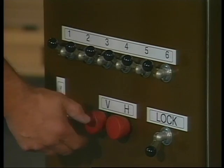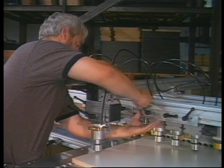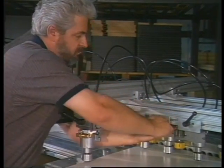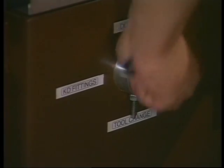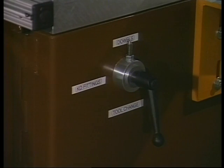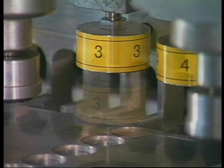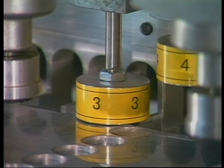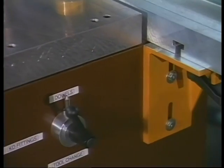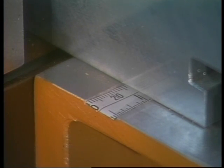For vertical boring, set the head selection switch to V and activate the red button marked V. Hold-down clamps are easily moved to maximize pressure on panels of different sizes. Next, select the turret control depth setting for dowels or KD fittings. Stops three and four are set to one-half the panel thickness. Stop three is positioned on the left of the vertical drill head and stop four to the right. The fence offset is set at one inch or 25 millimeters from the first drill bit.